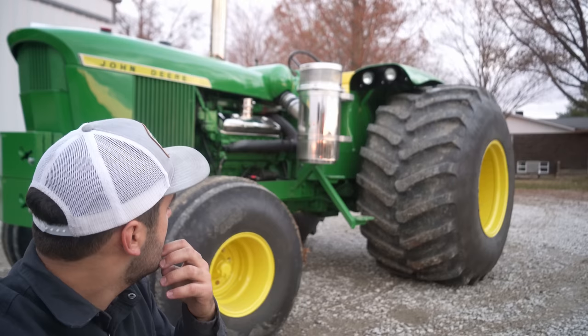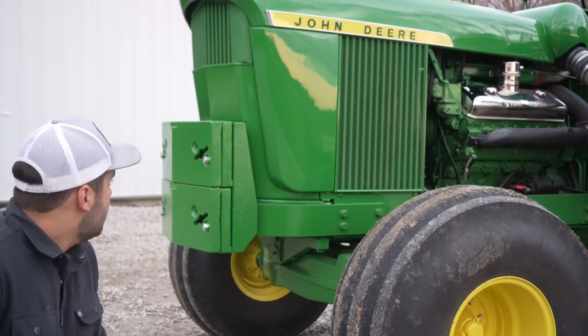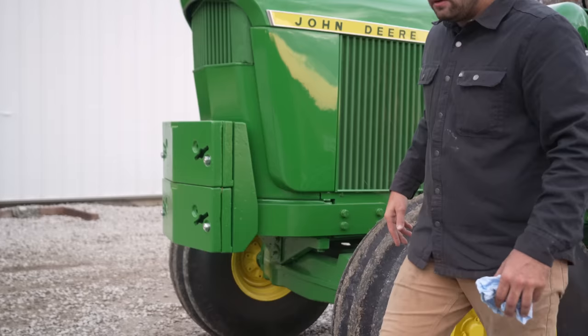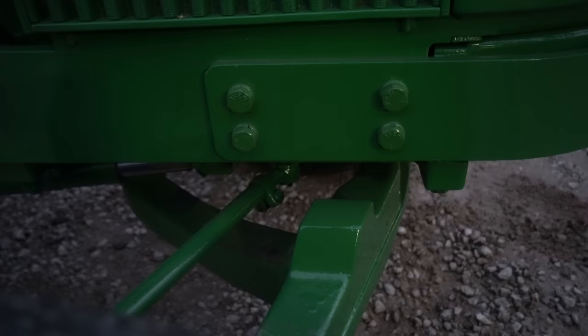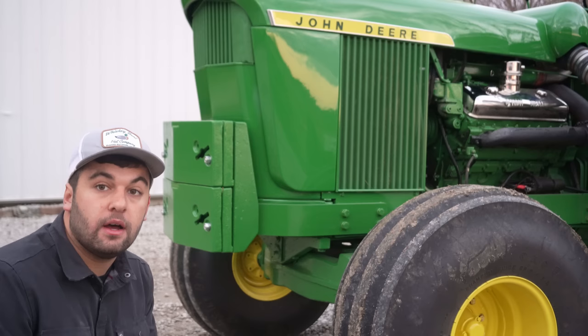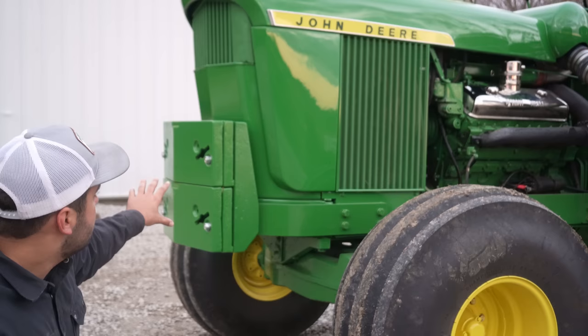I used John Deere steps we had laying around. Another big thing we did was incorporate a weight bracket system in the front of this tractor. With these frame rails and how everything is set up, we couldn't use the regular mounting bars. So instead of that, we had these new bars bent, and I welded it all up, drilled the right holes where they're supposed to be, and made a nice little weight bracket for this tractor. It's got the starter weight with the double stack.